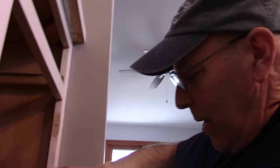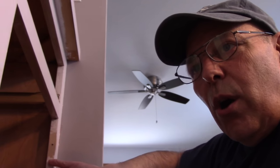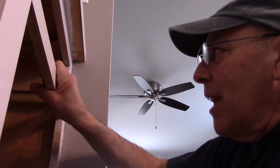Okay, now, as you know, we did take the doors off previously. You just take the screws out, we remove the doors and get them out of the way so that we have a little more room to work, and it makes the cabinets a little bit lighter. The screws themselves are right up in the bottom right here. It's in every one of the cabinets in the corner. So you see it here, and in the back over here, and so on down the line. So first thing we're going to do is take out the screws now.